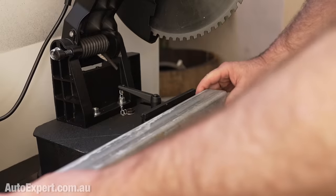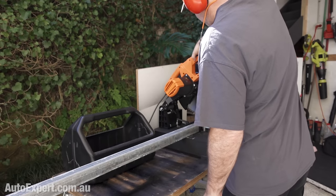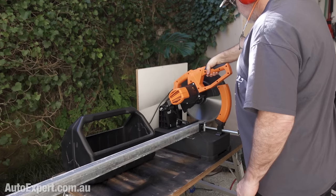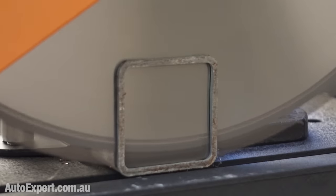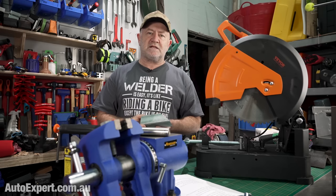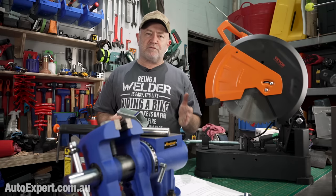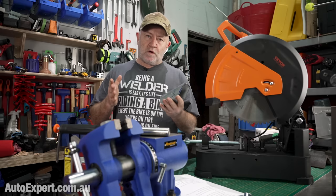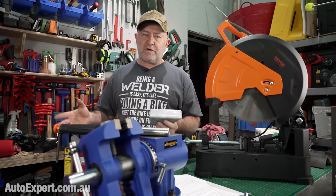When you get a new piece of material — say you've just had your long lengths delivered — the first thing you should do is take a real shallow reference cut off the end. That changes the crappy factory finish into a high quality finish compatible with all the other cuts you're going to do. When you start from a good reference cut, you can make a good first reference measurement, and that makes real sense if you want fewer problems in the assembly and finished product stage.